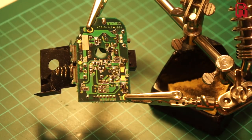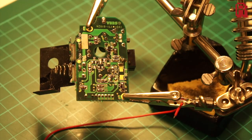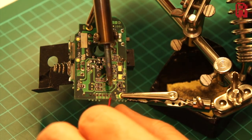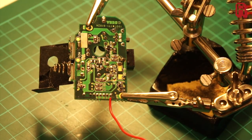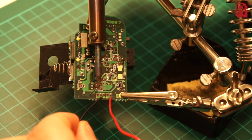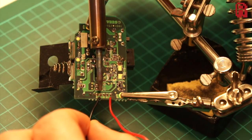Here are those pins again with the board on the solder station, ready to have some cables attached. The first cable is the 5 volt cable going to the first pin on the right. To attach the cables I'm putting a tiny bit of solder to tin the end of the cable and then just touching it onto the solder point, being careful not to create a connection between the two solder points. Now let's put the first ground cable onto the board — touch that on, give it a little tug to make sure it's secure, and then we'll do the same at the other end to attach the cables to the Raspberry Pi.